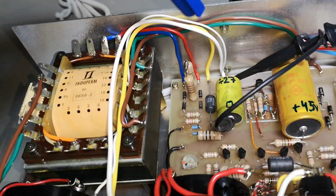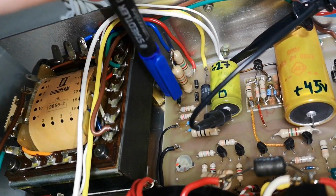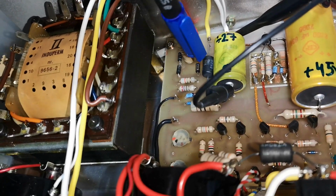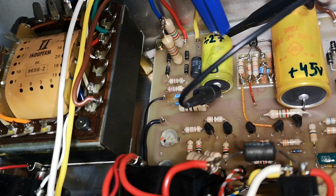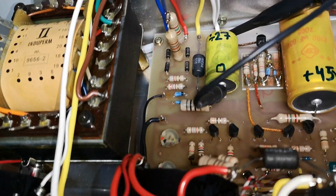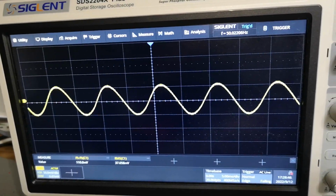And this is because they're using series resistors and the bridge. So this is a very good idea to charge the capacitor in a really nice and smooth way, so you don't have any high peak currents in the voltage reference system. So that is fantastic. And this is of course why the ripple looks like this.